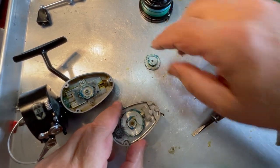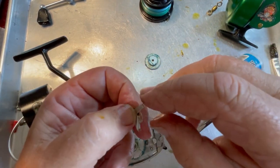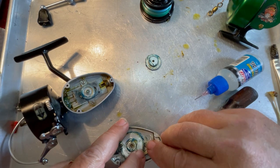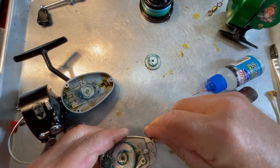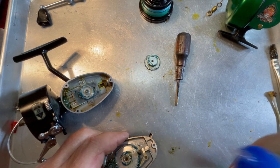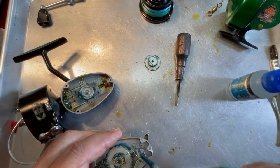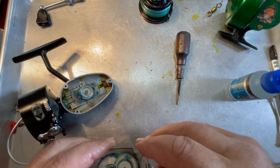Before we put this side on, let's put the anti-reverse lever back in. This particular anti-reverse lever is kind of preset — it's kind of hard to get it wrong. It goes in like this: that goes onto that post, and then this spring goes behind this post over here. This lever over here should now pivot. This is important — I don't think people have been oiling this post where this lever is, and these things jam up. They get a little corrosion in them and they quit working. So make sure you've oiled that post. Then put yourself a little dab of grease right there. Now we're going to set this gear back on — anti-reverse, let's turn it off.